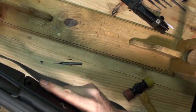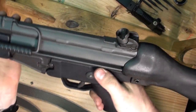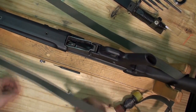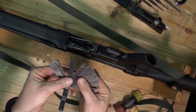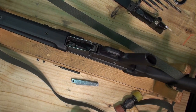We'll do the same procedure — pull back on the charging handle, let the action go forward, let it slam forward in a safe direction, dry fire. Let's find out how the Plus 4 rollers improved our bolt gap from the standard rollers. It looks like it's going to be 13-thousandths — so we went from 9 to 13, that's 4-thousandths from the Plus 4 rollers, and that's exactly what I expected. I'm really happy with this.